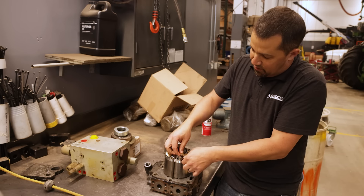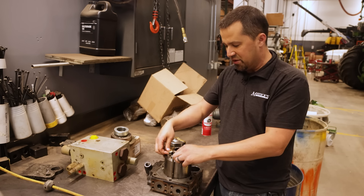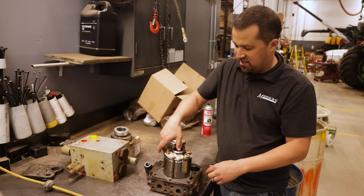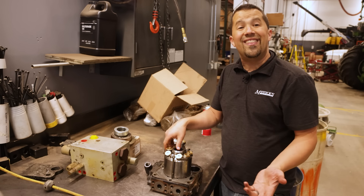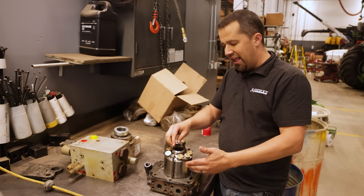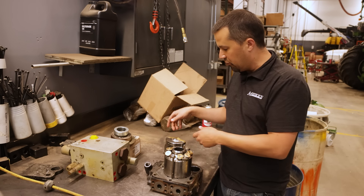What makes these pumps really cool is that they're variable. When they're in a neutral position, these things don't move at all — this can sit here and spin drawing very little horsepower off your engine. But as they pump at a longer stroke, it takes more horsepower to operate the pump.